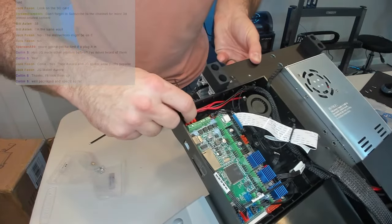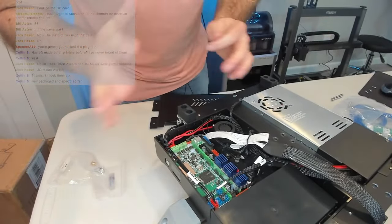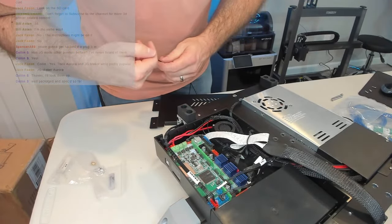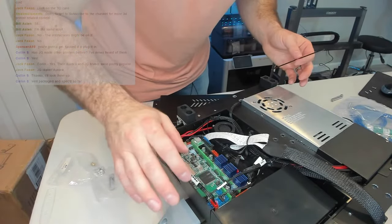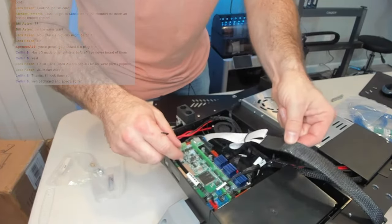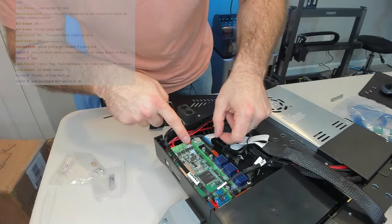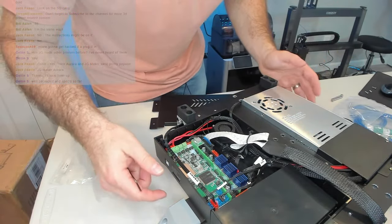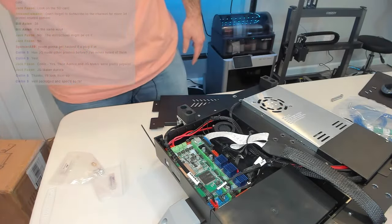All the terminal connectors right here, if you can see, are all ferruled. So that's good to see. Yeah, we like to see that stuff. What chip? STM32F103ZET6. I believe that's an older chip, but I can't be certain. It's an STM32. That's all we really need to know. Everything looks fine. Cabling is concise right in here. A little bent. Tons of glue. Don't like that, but whatever. It's a main board. Everything looks pretty okay. They really went crazy with the glue, though. How dare they?